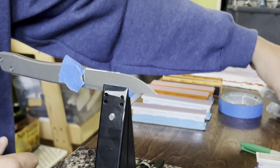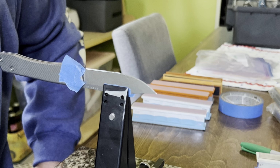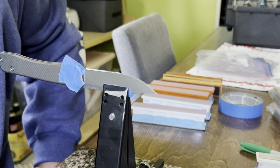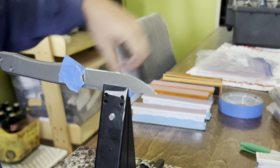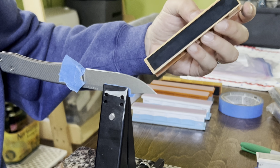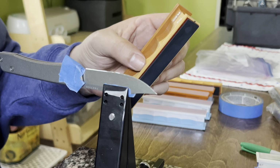And after that, we're getting into my strops. I've got 1 micron, 0.5 micron. I can't really remember what all it is, but I've got regular leather strops, I've got kangaroo strops, and I have nano cloth. On the nano cloth, the coarse side is 0.05 micron, and the final step is 0.025 micron. And I did just put a little bit more compound in here today.